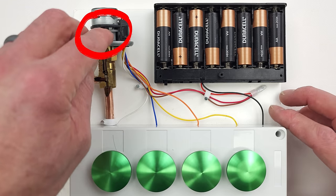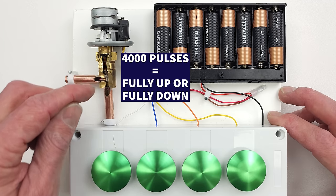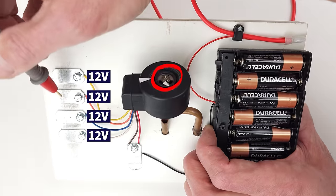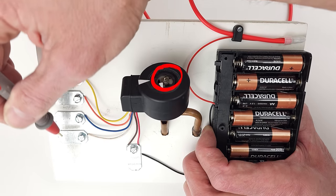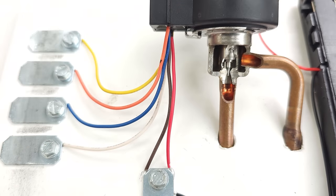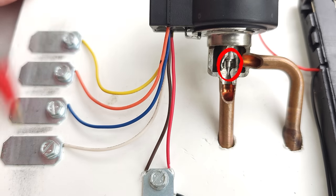I like to have students look at the tiny little gear on the inside and the very slight movement every time these 12-volt pulses are applied to each one of the four coils. That's 4,000 pulses for fully up to fully down. Compared to an EEV that directly drives the pin — like this style right here — you can see the top piece moving every time a 12-volt pulse is applied. That direct-drive version drives the pin clockwise or counterclockwise to rise or lower it, and with the magnet directly connected to the pin, it moves much faster. In this case it's only about 240 pulses.